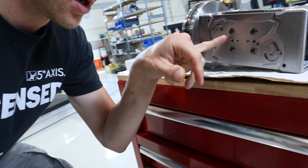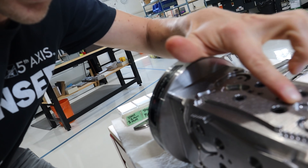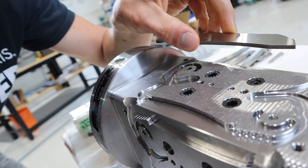That was some really interesting information — I have a lot of things to try now on the Norseman blade to get them tighter and more consistent. Right now I'm installing the gripper pads into the Norseman fixture. I've bored holes for each one, threaded the bottoms so I can screw them down, and got them installed. This way the blade will have actual purchase into the fixture and hopefully won't move at all. I'll probably do another video update if it works. Other strategies include reaming the holes better and improving every operation — we're shooting for that last 0.01%. Everything has to be perfect. It's a fun challenge.